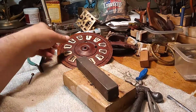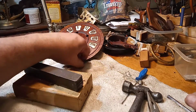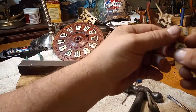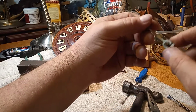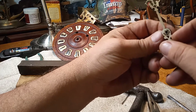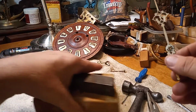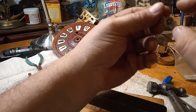Here I'm working on the French 1855 clock again. I went to check replacing the suspension spring, and the minute hand broke. The minute hand on the French clocks has a shaft with a square arbor in it, and this shaft came off the main hand. Because the clock was made in 1855, this hand looks original. I don't want to change hands, but I have to secure this shaft to the hand.